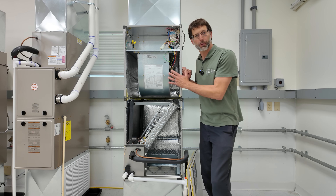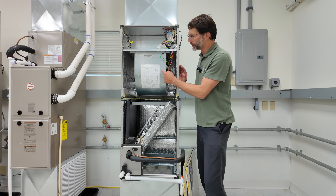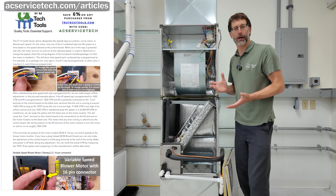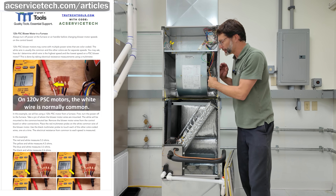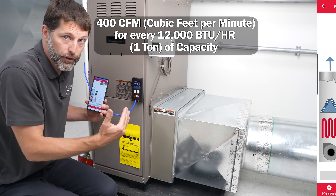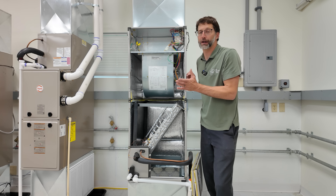You may have an airflow issue where airflow is too low, limiting the system's capacity to exchange heat at the coil. If the fan motor is set to too low a fan speed, you're not bringing adequate air across the coil and not conditioning the air properly. With the power off, you can adjust the settings to change the blower motor speed, and you can use the TrueFlow grid to measure your airflow. You're looking for roughly 400 CFM per every 12,000 BTUs of capacity for air conditioning mode. In a very humid environment, you may want to lower that down to 375 or 350 CFM.